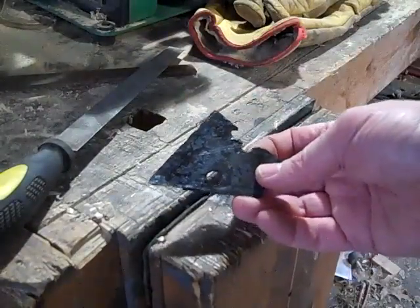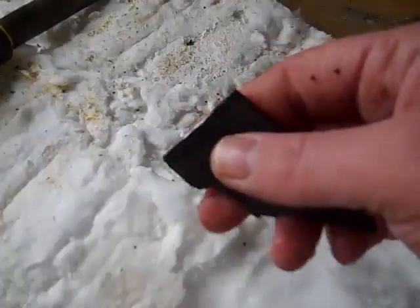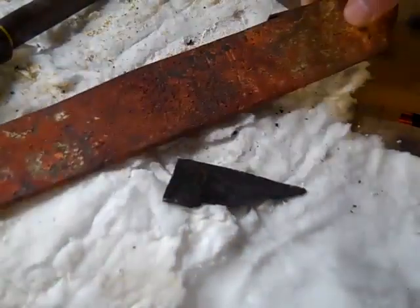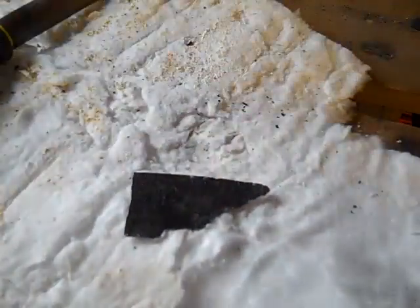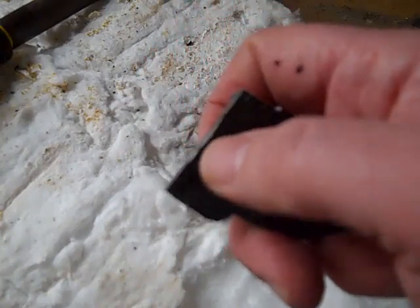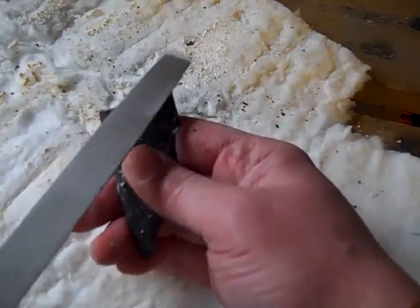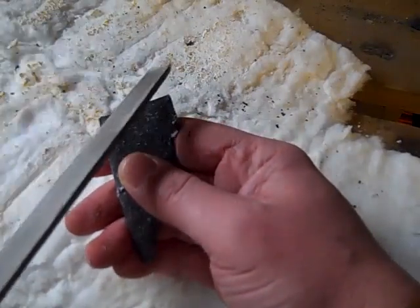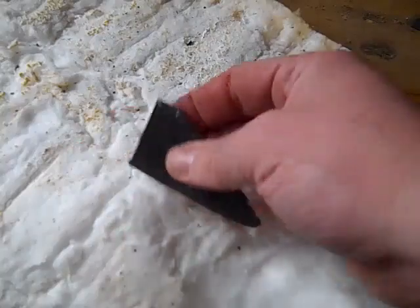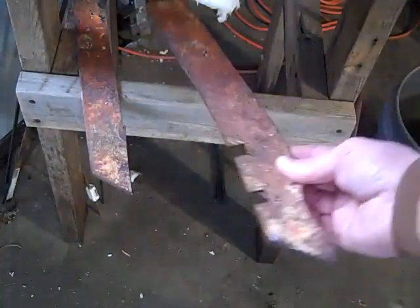At least the work I've done on the other piece has given me a little practice on my hand skills, but I'm not sure this particular piece of steel is going to be good for what I want it for. Now here is a contrast — this is a piece I cut off some chunk of metal from an old farm implement. I did the same test. There's a shiny bit right here where I filed it first, and the file cut it just fine. Now the file just skates off — I'm not abrading anything away from this, so I know this piece actually hardens up just fine.